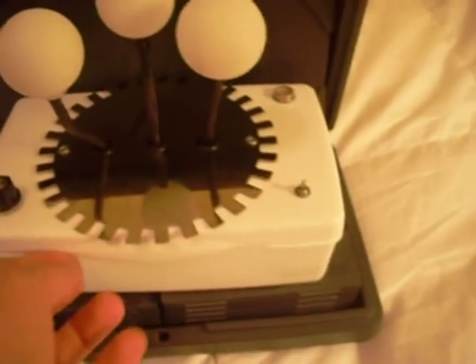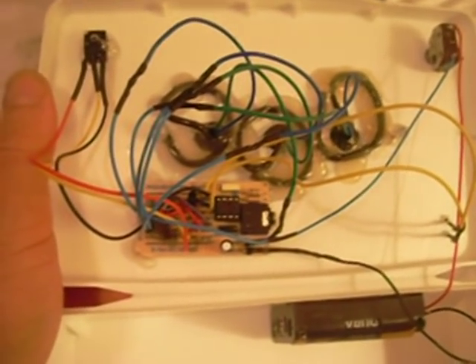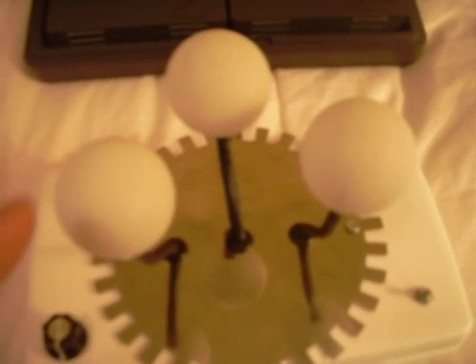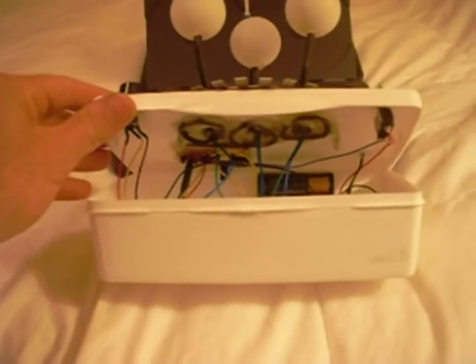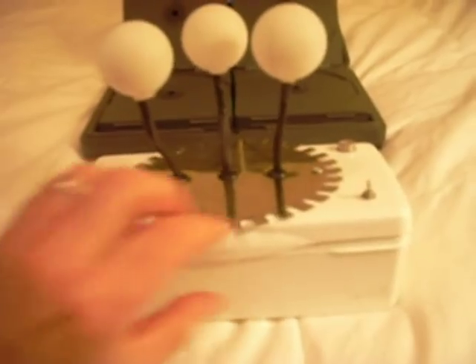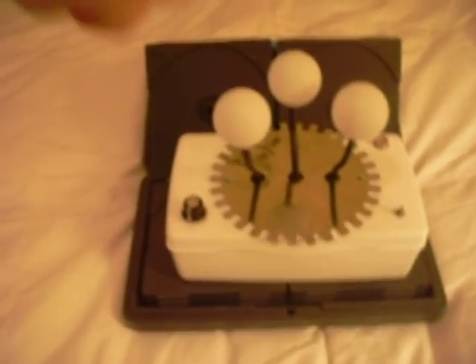The real main difference between Guy's design and mine is that he used three PICAXE-08s and I used a single one. Because of that, he had three RGB LEDs. Instead, I have three single color LEDs. I used the single PWM output of the PICAXE to drive the brightness for all three, and then I used the random function which was already in use in the code to determine which light lights up.